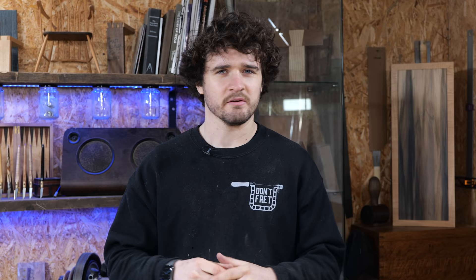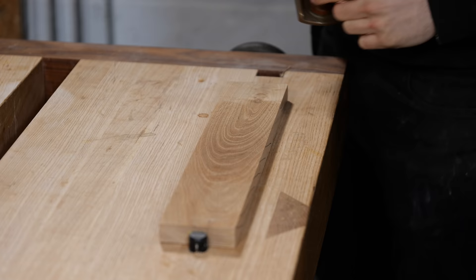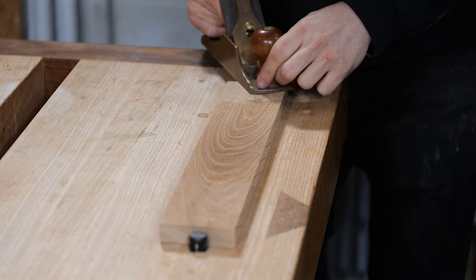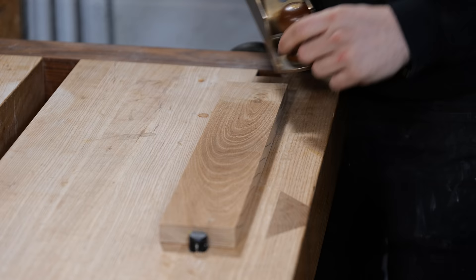So what does this actually mean? There are situations in which lowering the cutting angle increases tear out — meaning the flip side is that the higher the angle, the less tear out you get. One thing skewing the plane can be good for is reducing the resistance of the cut because it's shearing the wood fibers rather than levering under them and pushing them up. Pushing through at a skew is incredibly easy and you get these lovely curly shavings. Much easier than going in straight. But that is only the case if you're planing with the grain.